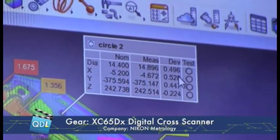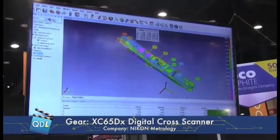You can do GD&T with that — true position, diameters, radiuses — limitless possibilities. So much greater wealth of information than you'd get with a simple touch probe, which might give you some basic features and whether you're in tolerance. But with a contour map and millions of points, you're really seeing the entire object and know everything about it. And we can go back to the data if we need to and take measurements that we may not have taken previously. The advantages are speed of throughput, much more data, about the same accuracy as a touch probe, and a much greater wealth of data to compare against CAD and understand the quality of the part.